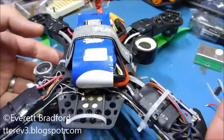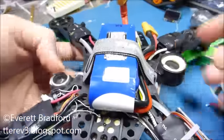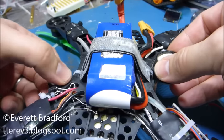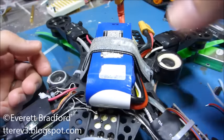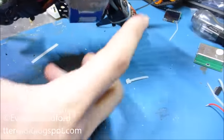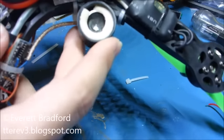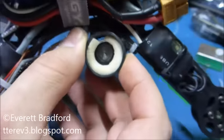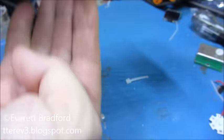So I took a number of steps to try to fix each of those issues. The first was separating the transmitter and receiver so there's some space between them, which got rid of any weird effects from bouncing off parts of the frame. Now they have to see an object pretty far away to get a bounce between them. I also shock-mounted the receiver in foam and it's fully surrounded in a plastic holder to shield it from directions other than down.